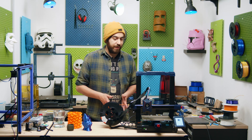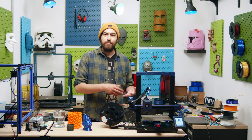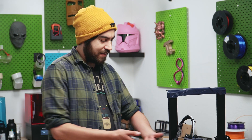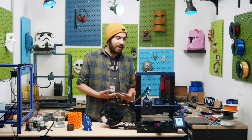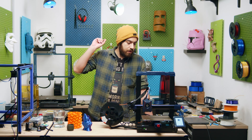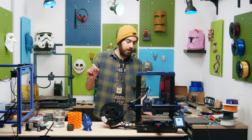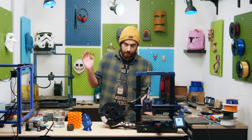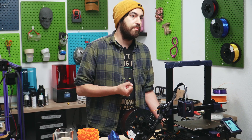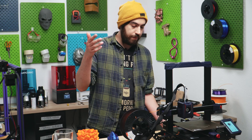At first I had some mixed feelings with this printer. It seemed like the designers weren't quite sure what the end product would be — like the weird filament-insert homing behavior, the constant extrusion, the ZL label on the Z motor, and the dubious need for the PTFE tube. They're not problems, just kind of weird. But for speed and quality, this bed slinger stands out among the rest. Right now there are high-speed printers coming out that can go over 500mm per second, but maybe you just want a low-budget option that can print up to 200mm per second — if that's you, this is something you should consider.